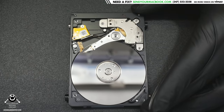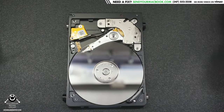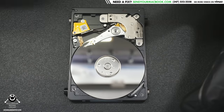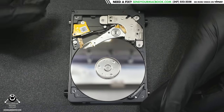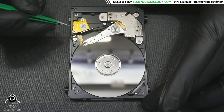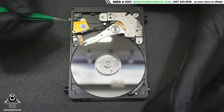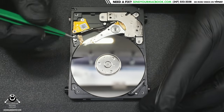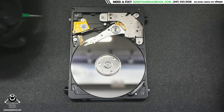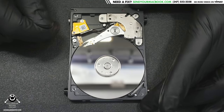This isn't a live case — it's already been recovered. A couple of people mentioned you shouldn't be over the platters, and of course not on a live case, but you need it for demonstration purposes. What I personally do in a case like this is unstick the heads. On Rosewood drives you don't have much room to work with, and even replacing the heads is a bit annoying. You cannot use the standard head unstick tools to get the heads back into the ramp.